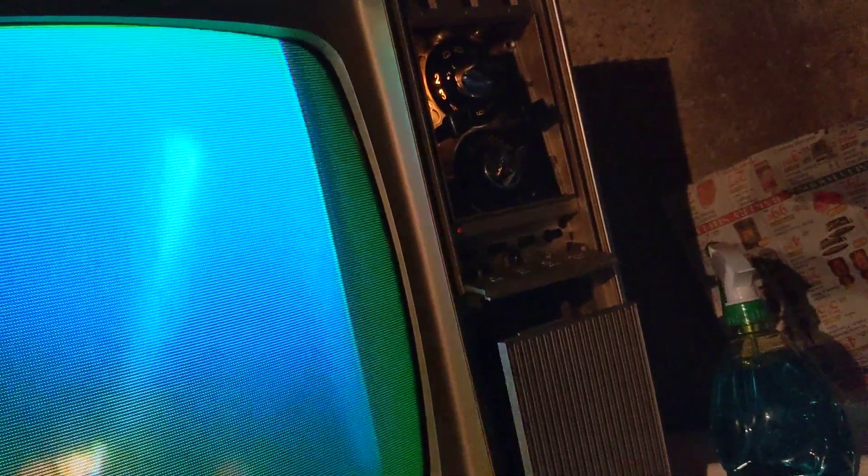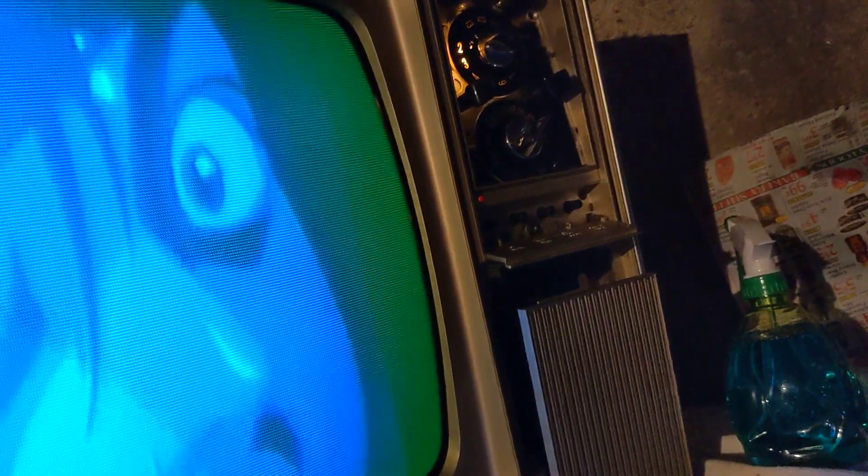The only things left to do on this TV are basically I just have two little electrolytic caps to replace on the pincushion board back there, but I don't need to take the chassis out for that. The picture tube is very much fine. The convergence is a little bit off, nothing horrible, and the degausser needs to be worked on as well. I'm not really sure why the degausser doesn't want to work, but I can get an electromagnet to degauss it if need be.